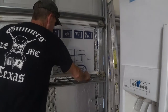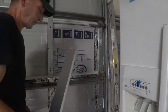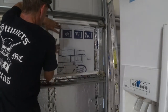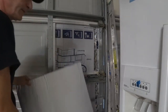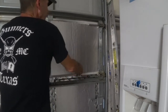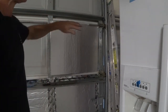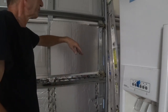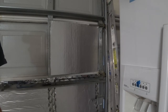So now we go with the 3/4 inch piece. We use a 3/4 inch piece to fill the gap. In this case though, I'm going to put on this end. That way you're overlapping our seams. Will it matter? I don't know. Probably not. Alright, so here's a little bit of a struggle. These screws all penetrate up in there and make it hard to slide the board. So I'm going to use my impact, remove those screws, watching carefully, make sure that something's not going to sag. The door's almost all the way to the bottom, so it can't sag too far. Let me do that.